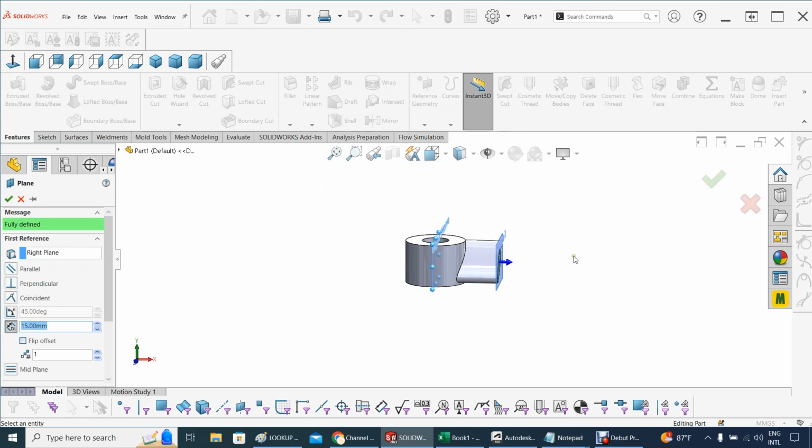And here's the story. Let's make that plane about half of the distance. So if I'm going to build a propeller which is 6 inches at each side, approximately for a 12 inch propeller, then I will say at 3 inches, actually 3 inches times 2.54 times 10. That would be the first 3 inches up to here, and then the rest of the 3 inches will have another angle.